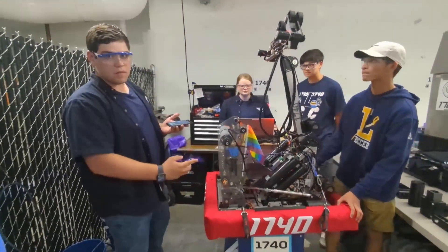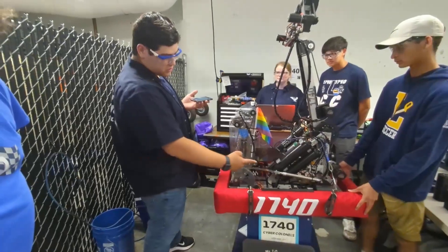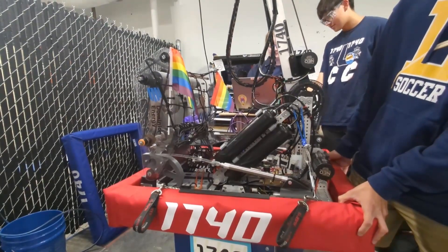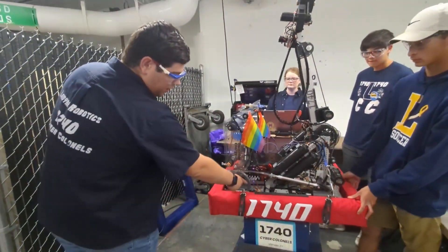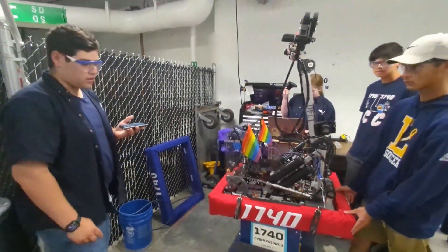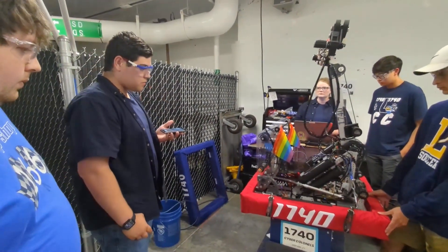We have a double-sided belt to help ease the rotation of the axles — we didn't really want to use gears, so we found this to be significantly easier. For the actuation, we use six-inch pneumatic actuators. We use a little cam here with some polycarbonate around it, and that helps us take the force of the actuators up and over the pivot instead of having a lot of force directed into the pivot. These are all 3D printed parts — it really helps with manufacturing these oddly shaped pieces, and it's a big part of what we do as a team.